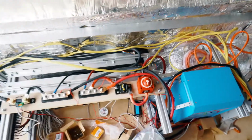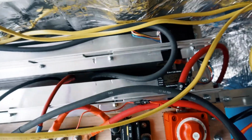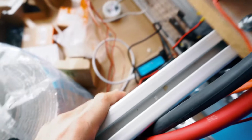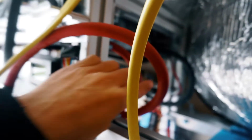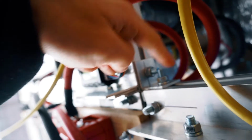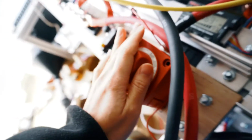Okay, now let's briefly work through, in detail, what is going on and what I have installed over here. So part 1, components. The Tesla batteries, we have 2 of them, and they are connected to the frame that we made with aluminum extrusion. And I took a 1/0 cable that comes out from the negative post to the negative bus bar, and the top one of a different cell comes to the main switch.